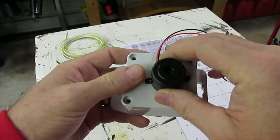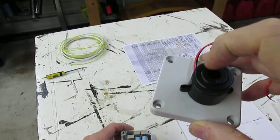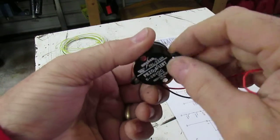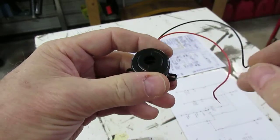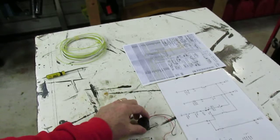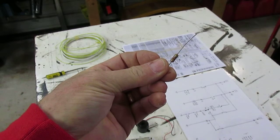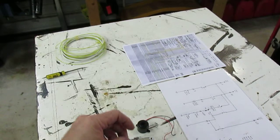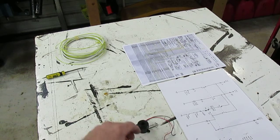This piezo electric horn is adjustable for the decibel level - all you do is drop the voltage to it. I think it's rated five to twenty-eight volts and the higher the voltage the louder it is. I found it was a little too loud for what I wanted, so I'm going to put a resistor in series to drop the voltage. I ended up using a 5K ohm resistor in series with it, which drops the sound level down to approximately the same as the original buzzer.